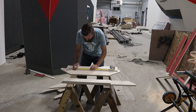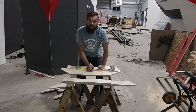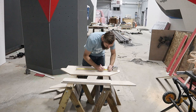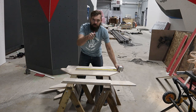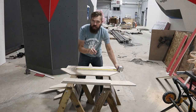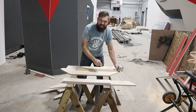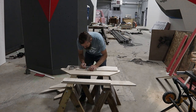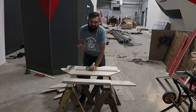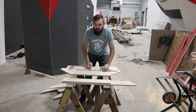6-inch hold is gonna be pretty good. So we'll go to 6, 12 1/8, 18 1/4, and then 24 3/8. Comment down in the description below why I am adding 1/8 inch to each one of these lines, if you know. Okay, got my square. Now these right angles are dumb, but they're easy.